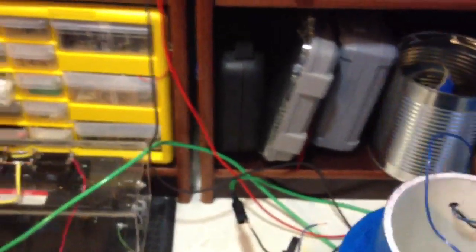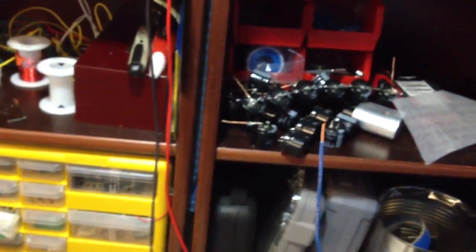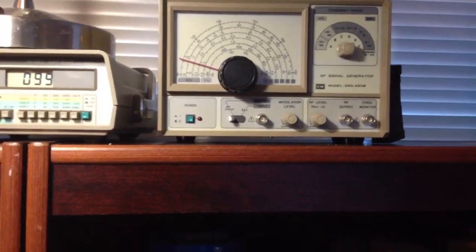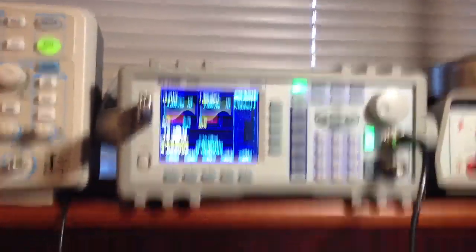One challenge I have right now is the secondary coil on the bifilar winding. When I run a frequency through it, it induces an EMF back across the second coil winding and into whatever is driving the frequency. I think I fried that RF carrier unit driving the frequency — when I dumped the energy from the capacitor bank, it pushed back through and fried it. So I'm going to try using an audio amplifier as a buffer between the function generator and the coil so I don't fry the function generator. I'll be testing different frequencies.